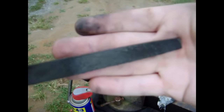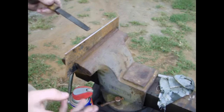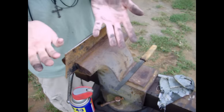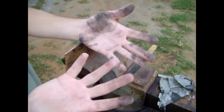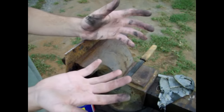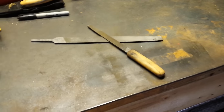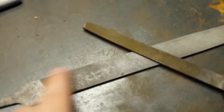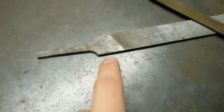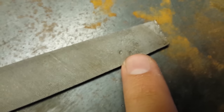The camera's not really focusing, but now all I'm going to do is spray these down with a bit of WD-40 and clean them up some more. That seemed to work really well — it cut very well, especially that big one, considering it wasn't cutting hardly at all before. These are the files after being hand-washed in warm soapy water and they cleaned up very nicely. These are Nicholson files and they're working pretty good.